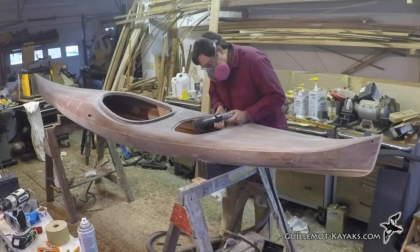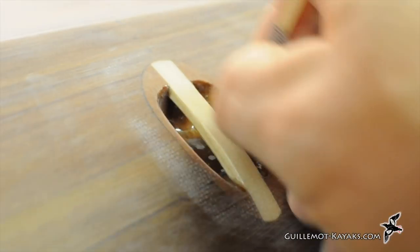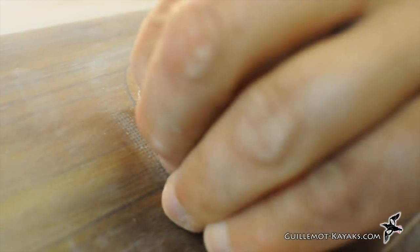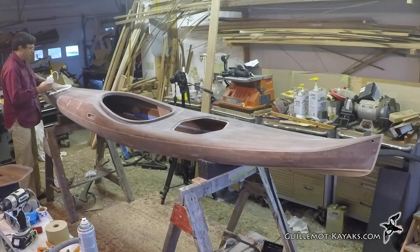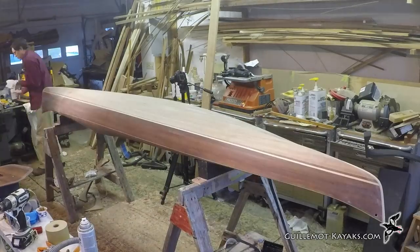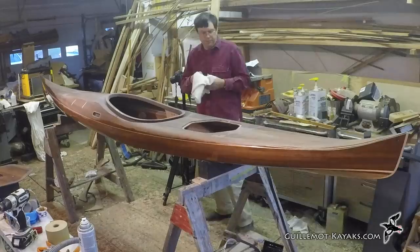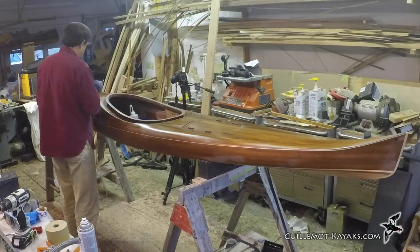The final cleanup starts with a thorough vacuuming to remove as much dust as possible. The cups of these recessed fittings are a bit tricky — a snippet of sandpaper on the end of a stick does okay reaching in. Epoxy is an excellent base for varnish, but through all this work it may have accumulated some contaminants. I first wipe the whole boat down with denatured alcohol to clean off any epoxy-related residue. I follow the alcohol with a mineral spirits wipe-down — mineral spirits are compatible with varnish and should clean off any oily residue which might interfere with the varnish cure. That will be left for the next episode where I will apply several coats of varnish with some sanding in between. If you're enjoying this series, please hit like, subscribe, and share. Thanks for watching, and happy paddling!